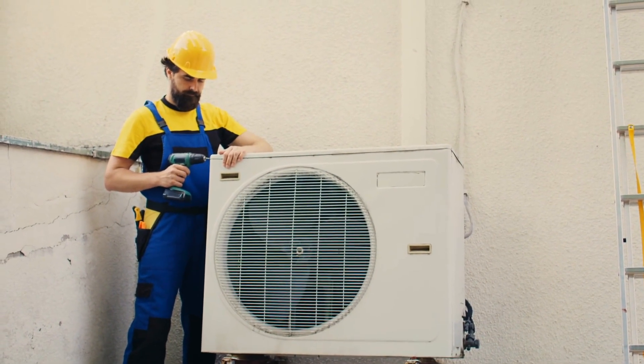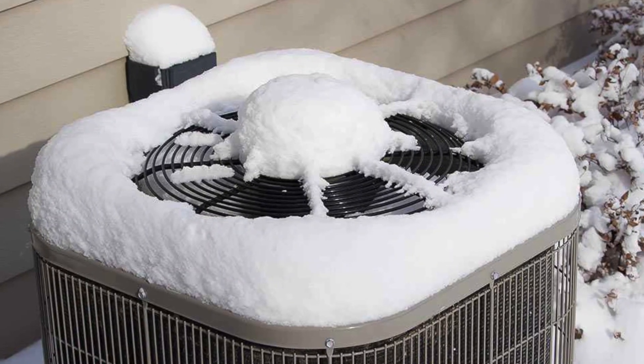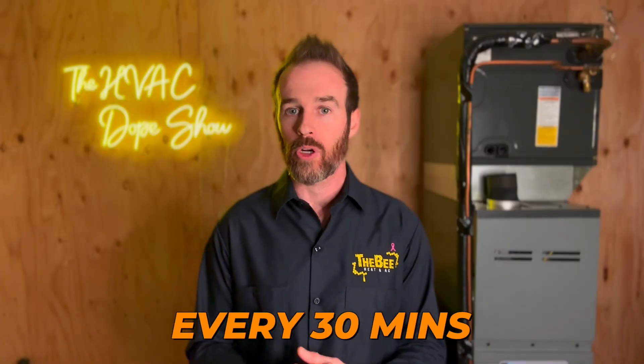Make sure the contractor you choose is familiar with the necessity for certain systems to have a heat pump stand for the defrost cycle. Most side discharge heat pumps will require a heat pump stand or wall mount so they can drop their ice during the defrost cycle. A defrost cycle happens in every heat pump because the condenser outside gets covered with frost and ice while running — typically every 30 minutes. The system will reverse the flow of refrigerant to thaw the condenser, and during this time you won't get heat coming through your vents.